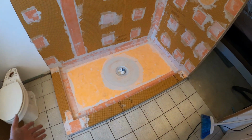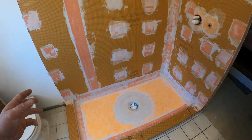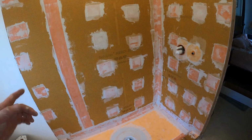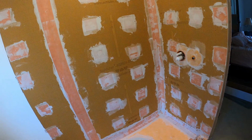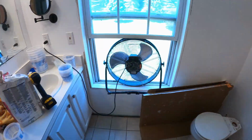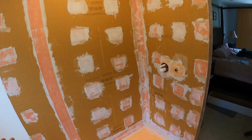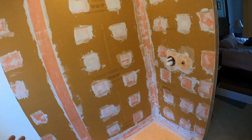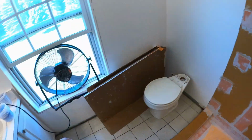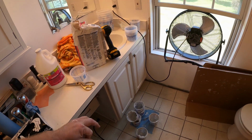So here, this should be waterproof now, right? We did things per the instructions, except we didn't use Thinset, we used the acrylic Ardex. So we used Ardex 8+9 instead of Thinset on the Kerdi board. So according to Kerdi, this is waterproof. This is good to go. Because this is rollable, it's paint, you can make the paintable mix. So we're going to mix up paintable.